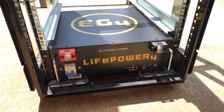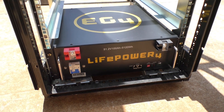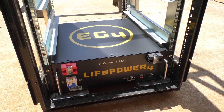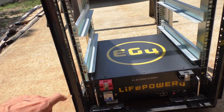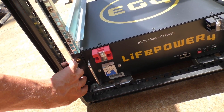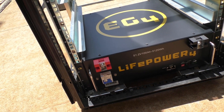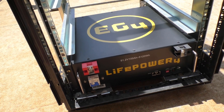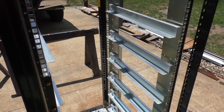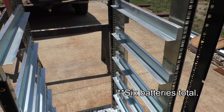We tested one of the batteries inside the cabinet just to see exactly how much room we had and how parts were going to physically space out. The shelves are kind of setting the pace on things. These holes aren't lining up really great, so I may need to modify the bracket or space up the battery to make them line up better. We've added shelves for up to six more batteries — might as well leave the flexibility.